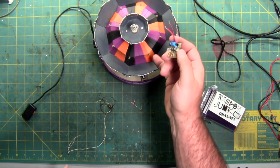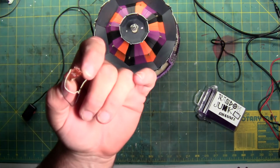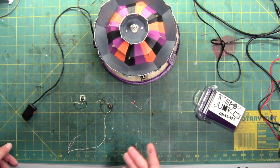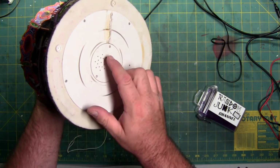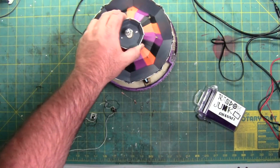The LEDs, of course, are underneath the lip, and that's what these wires would go to, as an example. The two are hanging off. So it does turn, it does light up, does not produce sound. I have tried everything I could think of, but I'm getting no signal out of the blob chip to the amplifier. The speaker and everything's still in here. It's still in the bottom. It's right there. The clunking you hear is the characters moving back and forth on the metal shafts.